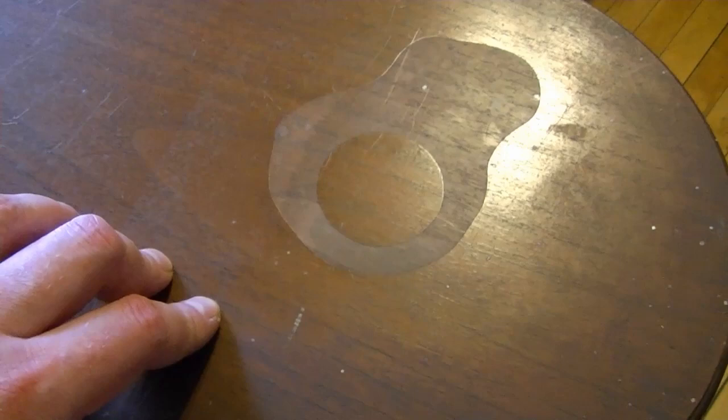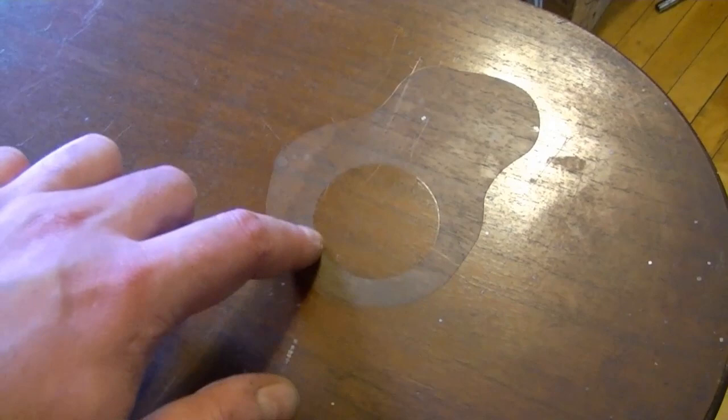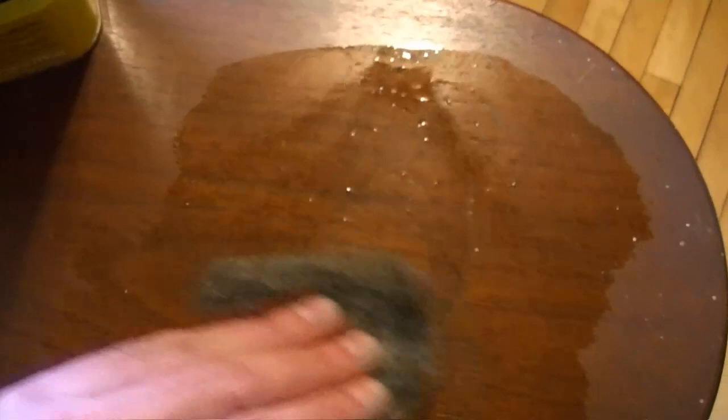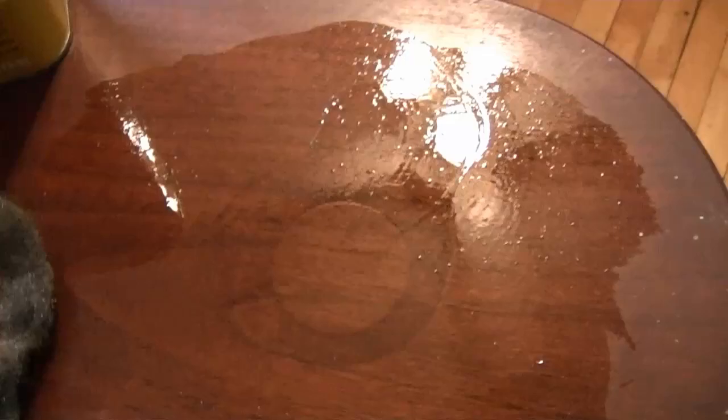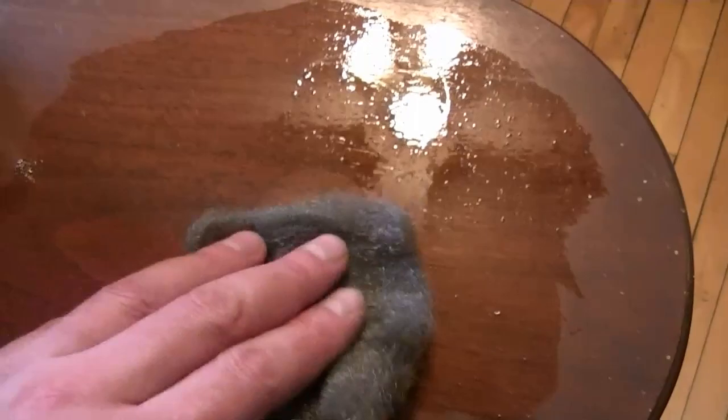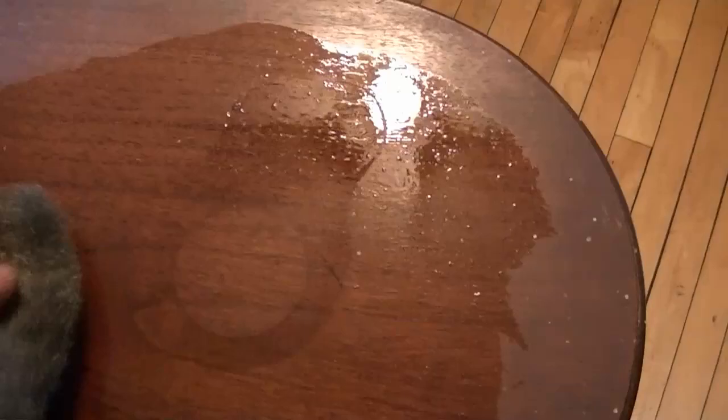What I suspect will happen is that there's actually a bit of color in this finish itself, so it's going to be lighter in this area — but it's definitely worth a shot. I'll put a little mineral spirits on some steel wool, rub over this area to clean it, and also get a preview of what it would look like with more finish on it. It's still obviously noticeable, but not as noticeable as I thought. So I'm going to do a little more rubbing with the steel wool to soften up the edges, clear off all the flecks around the whole top, and just put on some more layers of finish — forget about stripping it all down for now.